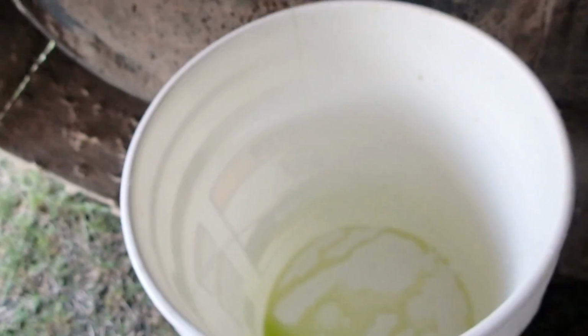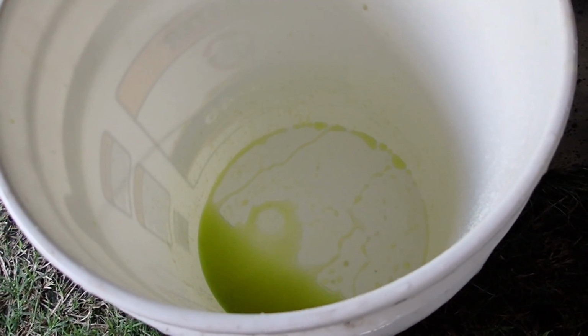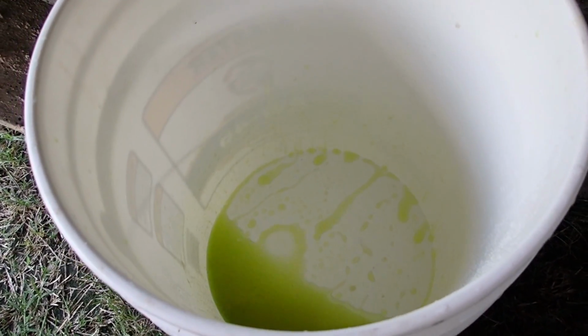So I'm gonna see if I can't drain this out. I found it's got a little drain valve on it down here. I don't know exactly how much crud's gonna come out that little hole, but I'm gonna drain it out and see. I'm gonna go get some flush and some new antifreeze. Fill it up, let it run for a little while, and drain it out and kind of see how much crud comes out of it.